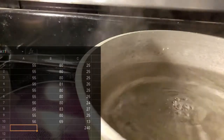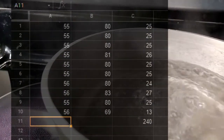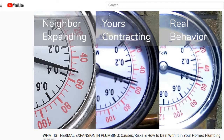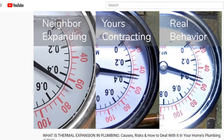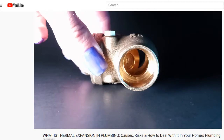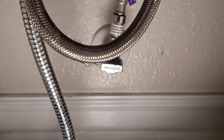Why do we care? Starting at 55 PSI and adding an additional 240 PSI brings us to a grand total of 295 PSI. If you have an open plumbing system, anything above the water supply pressure gets pushed back into the city supply — your neighbors absorb it into their plumbing systems. This is totally different in a closed system. If you have a simple check valve, the pressure will build up, causing wear and tear on your appliances and faucets and creating a volatile situation in the water heater.